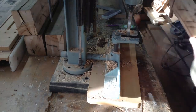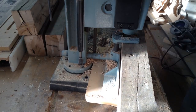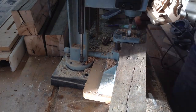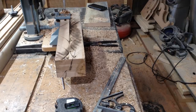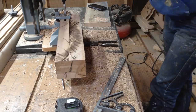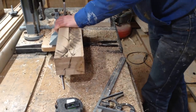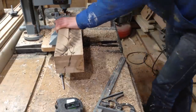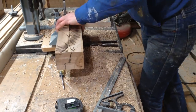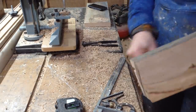The first go with the mortising machine is always the hardest because there's nowhere for the material to go, but once you have that first mortise it cuts through the material really well. Since I already have the marks from where I cut my dado I don't have to re-mark anything — I'm just going through and cutting out the rest of that material on the bottom half. You clean it out with a screwdriver, and then that's what it looks like.